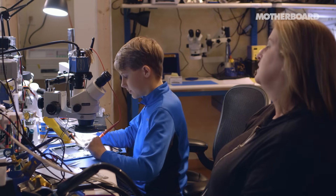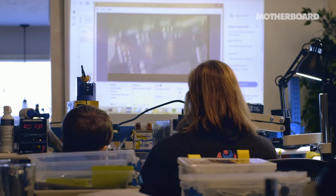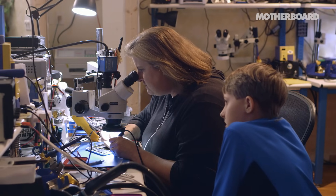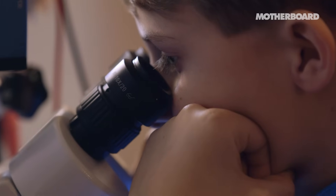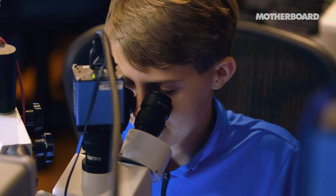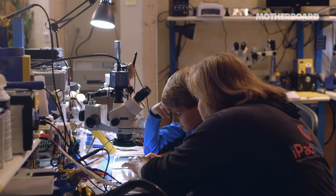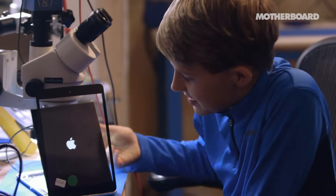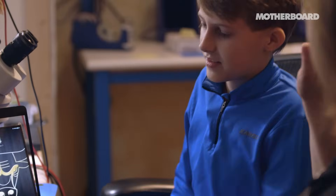No beep. What does that mean? It's bad — exactly, it's a bad filter; nothing will go through it. So you're going to put a blob of flux around here, and then very carefully go down there to the bottom of the board. Get it hot for a few seconds — heat it all the way down to the bottom of the board on both sides. Place it more or less back in the spot. Grab it with the hot tweezers and press it onto those pads. It's time for the moment of truth. You didn't kill it — it's still detected. Of course I didn't kill it, I'm a pro micro solderer now! High five!